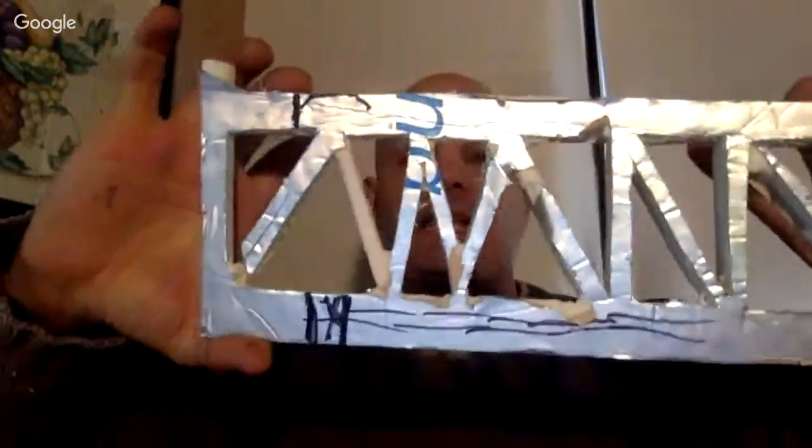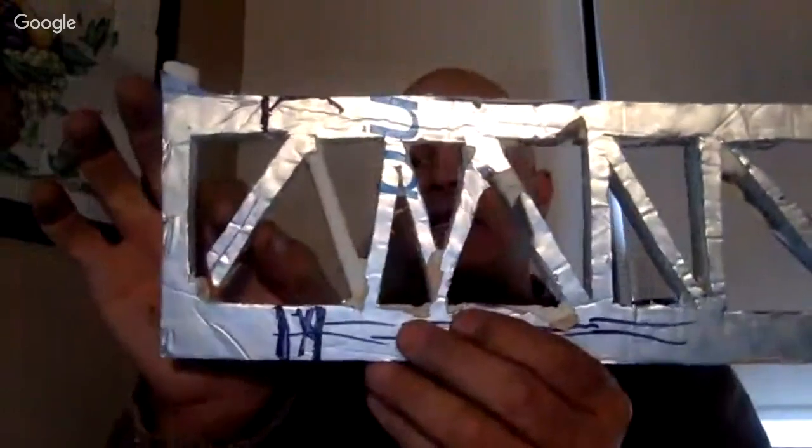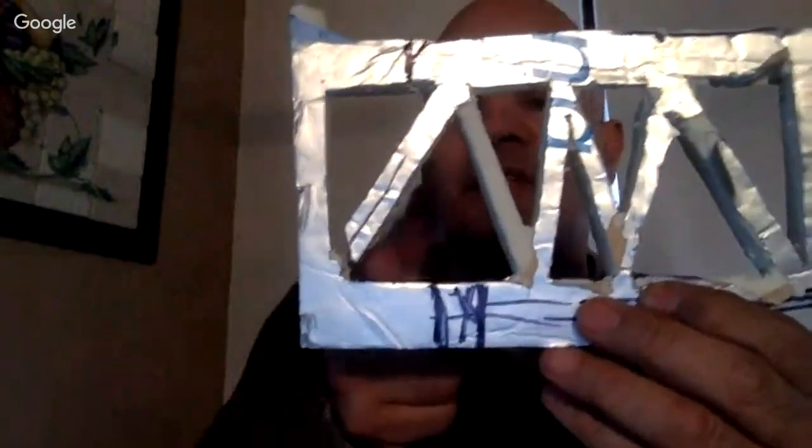It can't take the load. It's trying to transfer it out to the pier. It can't do it. That's why you don't see failure down here, because these are still transferring the load pretty significantly. Whereas this one, I'm saying, is not transferring the load, forcing it down number 10, because by default, if I remove number 11, the loads will still translate out to the end of the pier. They have no choice at that point but to do number 10, now making this an unsupported span.